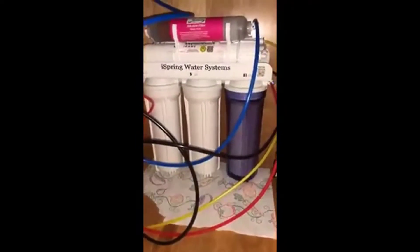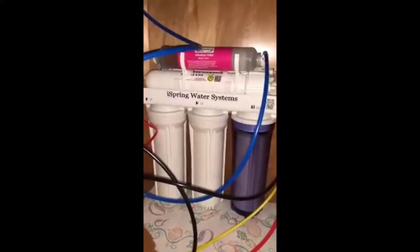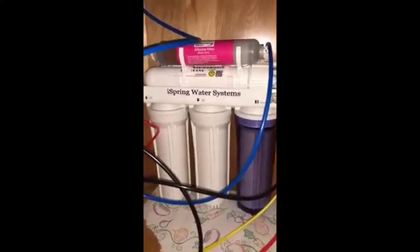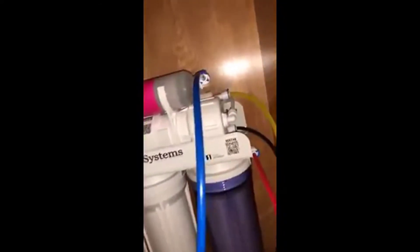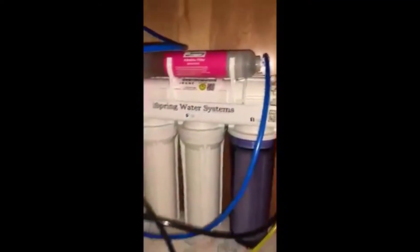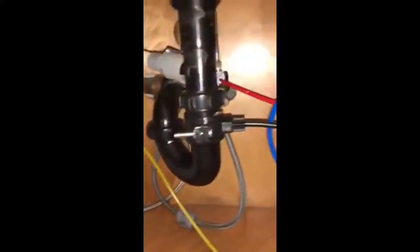This review is for the RCC7AK six-stage iSpring water filtration system with reverse osmosis. The reason I chose this water system is because it has the alkaline filter, which is better for you to drink. It also comes with a two-and-a-half gallon pressurized tank. I did have a problem in the beginning because I did not attach all of the hoses properly with the little blue clips — they need to be inserted all the way. It did drip and leak, but I fixed that and now I have paper towels there just to check. You'll need to tap into two lines: the drainage pipe and the inlet pipe.